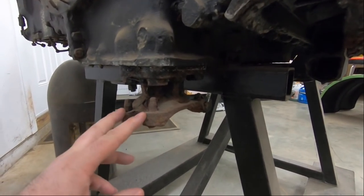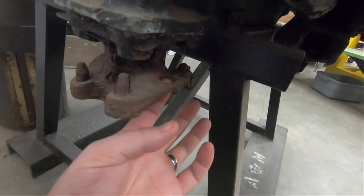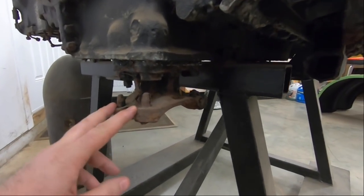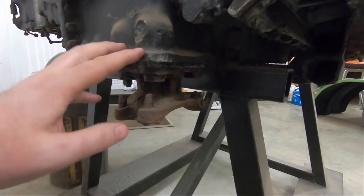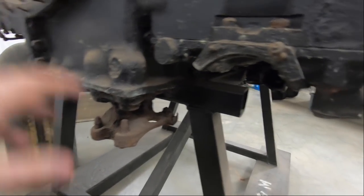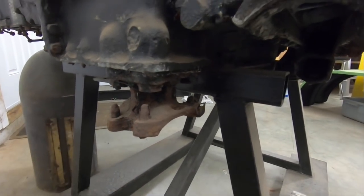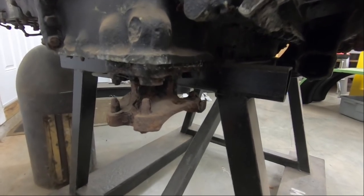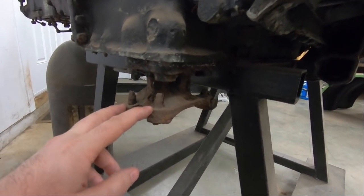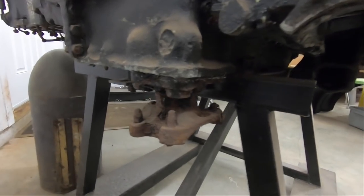One thing that's a bit of a tip: this is the rear engine mount. If you remember from the episode I did about the cross tubes for the cockpit section where I was pulling bolts — there's a pin and you can see the holes. The Typhoon, with its vibration issues, had vibration transferred from the engine directly through these solid steel feet into that cross member, which was the spar carry-through. Later Typhoons were fitted with a rubberized rear mount to help isolate some of that vibration, so this is quite an early one.